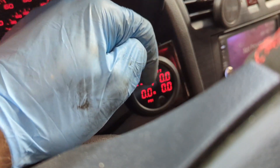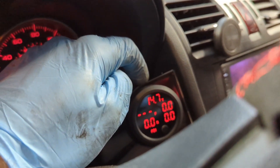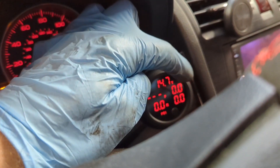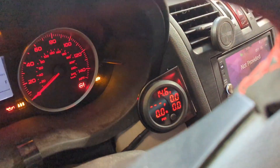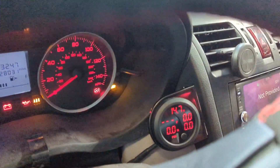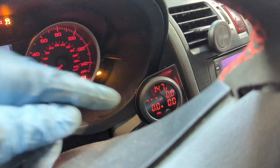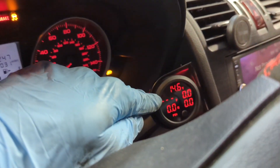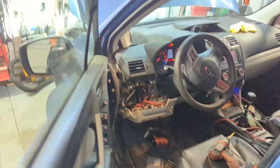The other two spots at the bottom are the inlet and outlet to the oil cooler. Those two are before the oil filter, and this one is after the oil filter. I wired all these up because the gauge and sensors were cheap, and I just wanted to see how much of an oil pressure drop exists in different parts of the oiling system.